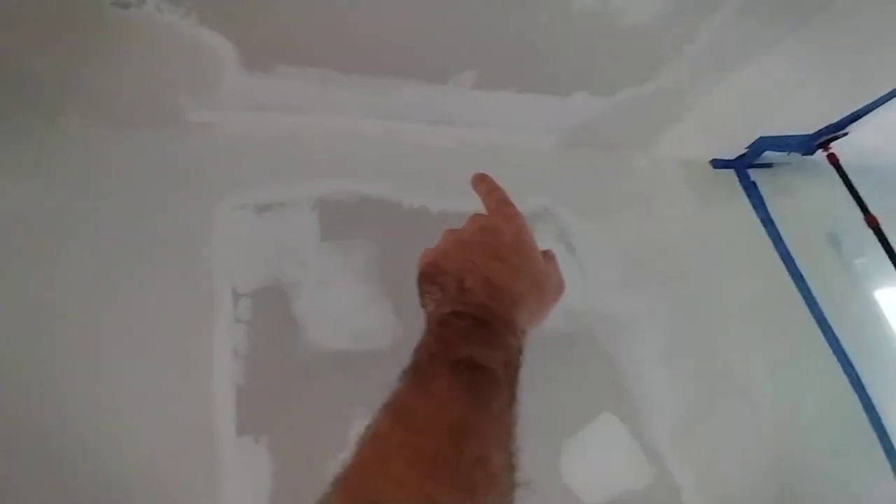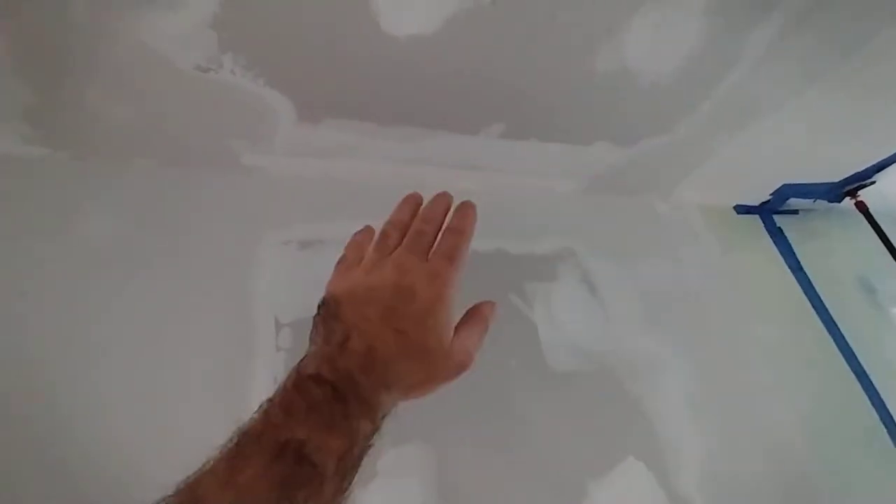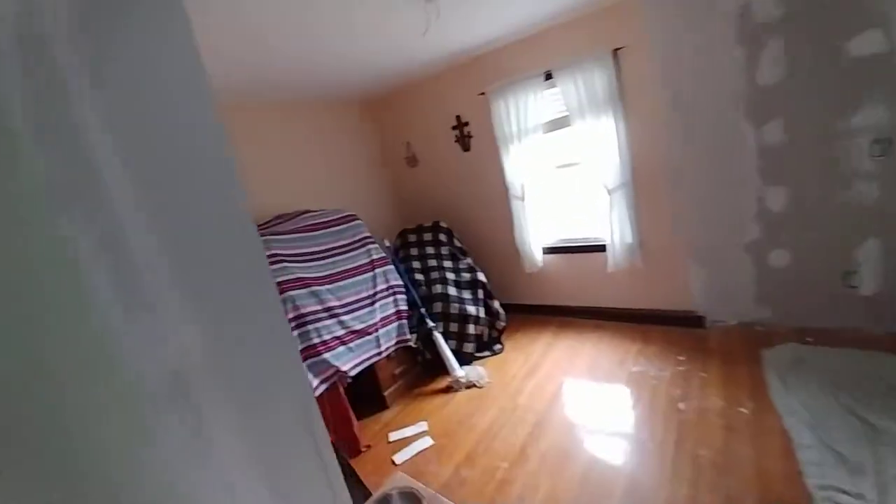We did one side of the inside corner transitions from wall to ceiling — we did the wall side of all of them, and we'll need to do the ceiling side next when we come back. So the wall side is done here, ceiling's undone. Same here — wall side done, ceiling's undone. Then we put our outside corners on. We got that one last time, so we filled it and lightly filled either side of both outside corners. It's just sort of a waiting game.